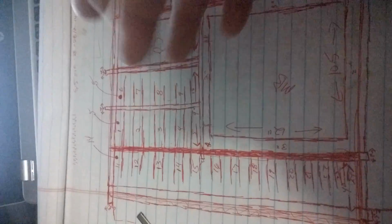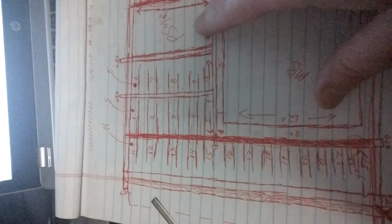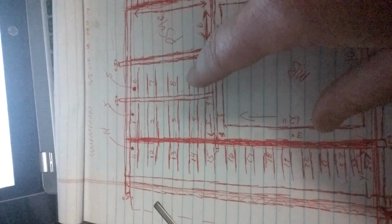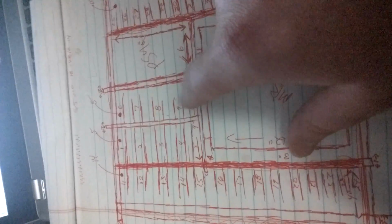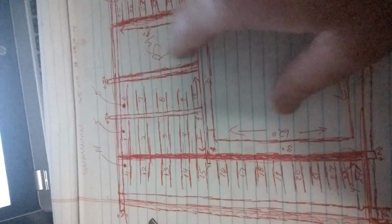Molex is nothing. But I wanted to make sure that it was equipped, and the way this particular power supply is set up is that the PCIe's and the 12-volt V1 are on the same rail, which means I can pull up to 1,000 watts off of the V1 rail, which obviously we're not going to do, but you don't want to burn out a power supply.